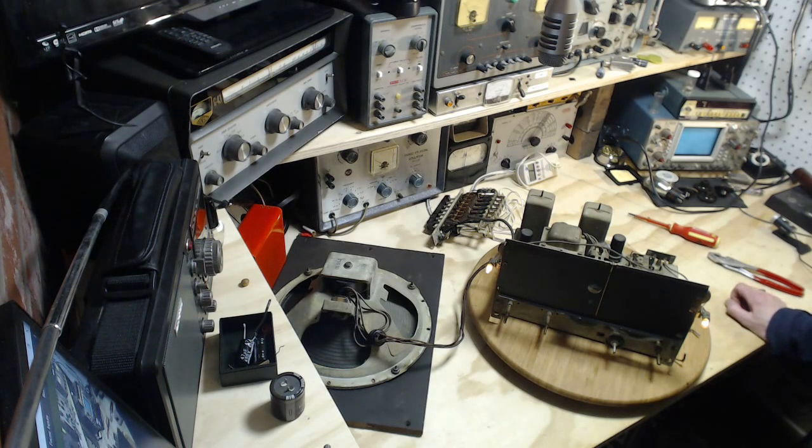It's totally dead. Now, for all I know, the radio part is working just fine. It's just working away here, but its signal is not making it into the amplifier. Another possibility is that B plus is really not getting through this radio, so some of these tubes are totally quiet, especially the output tubes. That's probably the next step, is just make sure that B plus is getting to the output tubes properly.